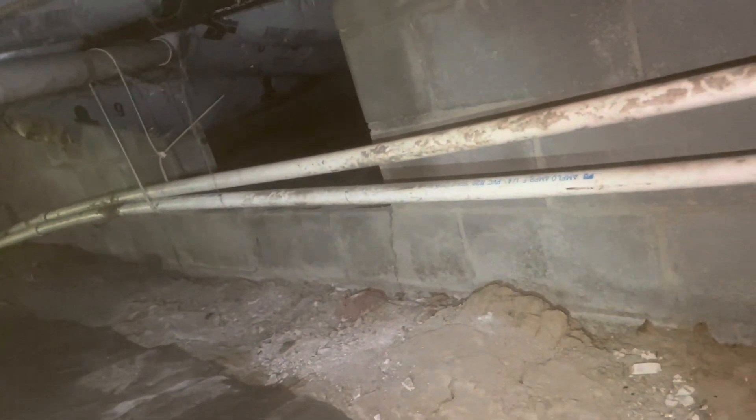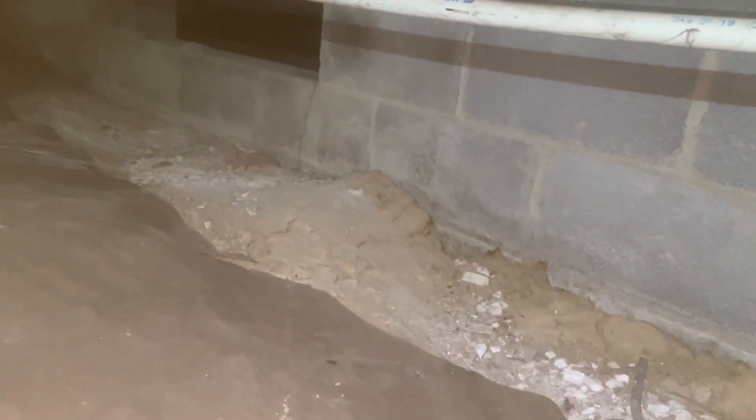These are the condensate lines coming from one of those room extensions. They come here and then they do kind of a humpy-bumpy run, and they're supported by only one zip tie with a couple of loops in there. I'd recommend supporting that every couple of feet to the joist above so it has a nice even slope. What will happen otherwise is the condensate will back up and overflow in the house.